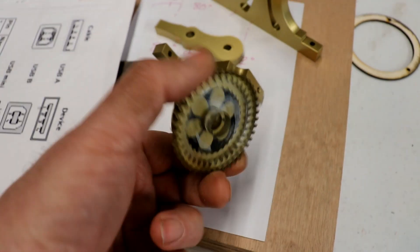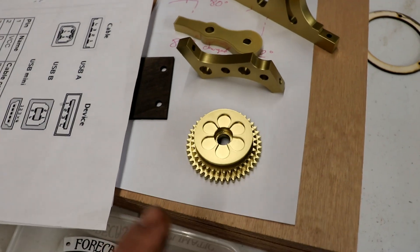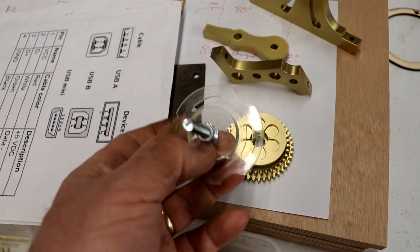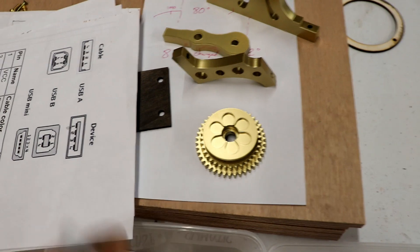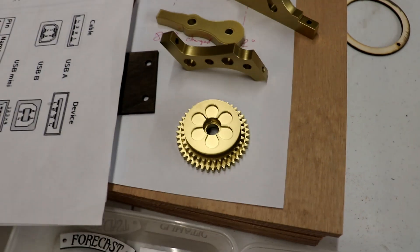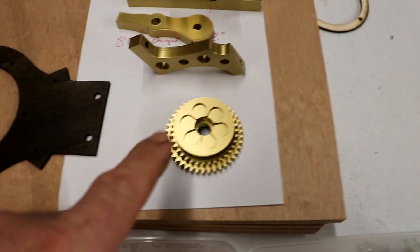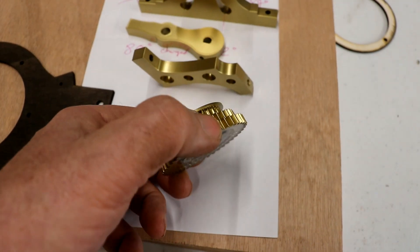They're going to go in the top of that and in the bottom of that — 6mm internal, 13 or 12mm outer, and 5 or 4mm thick. And then that is going to sit on there so I can adjust it from the back to get the tension of the chain right and the gears lined properly. I've been waiting a whole week now — doesn't sound long, but some companies deliver next day or a couple of days. It's now just over a week. It was Technobox Online — they're a good company, but they always do seem to take ages to deliver things.